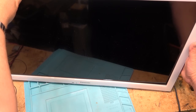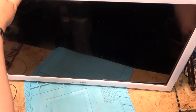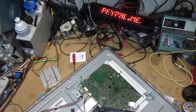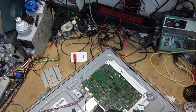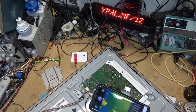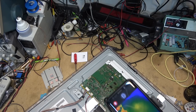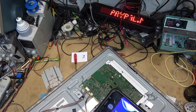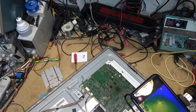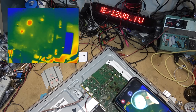It pops out the speakers but goes right to that 9-blink code immediately. I'm going to use my thermal camera — I'll put it in rainbow mode and record. I'm going to power the set up and see whether anything on this board changes temperature in that brief few seconds while it's on. I've just powered it up — oh, look, those chips are getting hot right away!